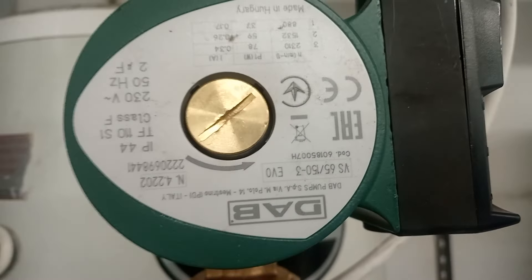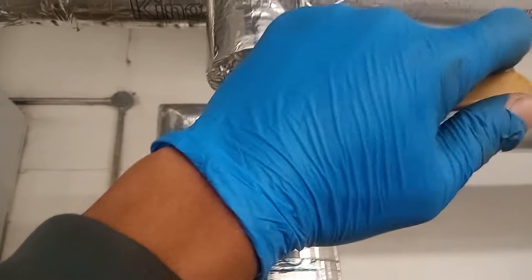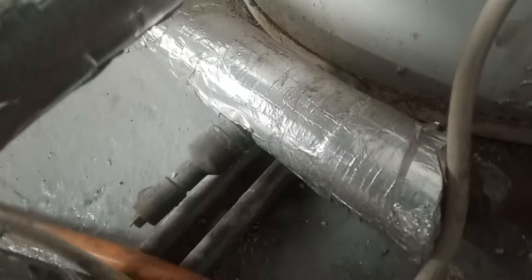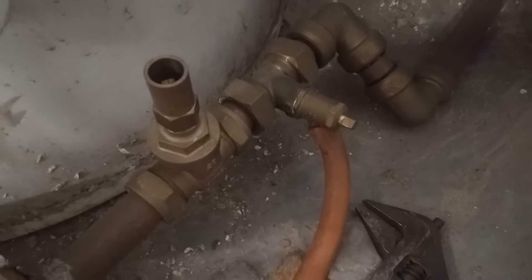The secondary return pump is now off and the valve is off. I'm using the drain next to the expansion vessel as opposed to the other one because it's easier access and it looks to be in better condition. I'm going to drain it down, and while it's draining I'm going to break the connection on the heating element.